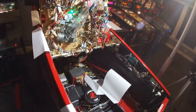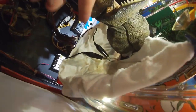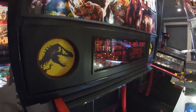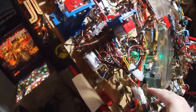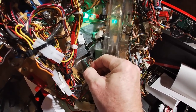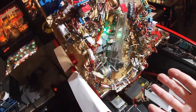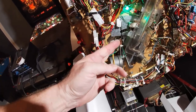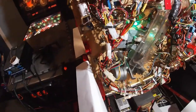Just when you think you've got it figured out, something else shows up. I've got the switch out and was able to pull the wires out. I've got the two wires jumpered with that diode I made, simulating a closed switch, but the bottom switch still reads off. I started messing with some wires back here and as I was touching them it was going on and off. I finally figured out the wire that was daisy-chained to go to the switch out of the up-switch was not really in there — just intermittent. So there's no power. Once we hook this back up, I expect that switch to work.